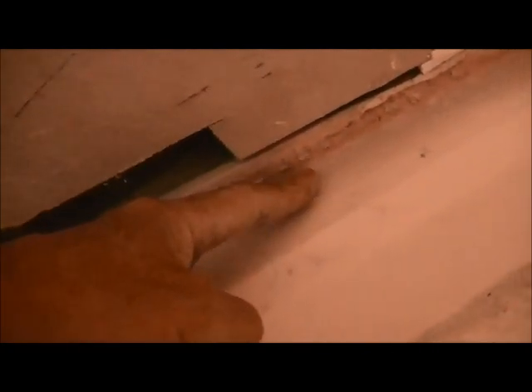What happens is water will leak up under the bottom rail that was glued down, and somehow manages to find its way up and over. These little lips on most prefab shower pans and bathtubs are there for a reason - your backer board sits on top of the lip and then your tile overlaps it, so you don't soak up water into your board. Often builders will put the backer board over the lip and right down, causing water to transfer through and get sucked up the bottom of the boards, causing mold and mildew.